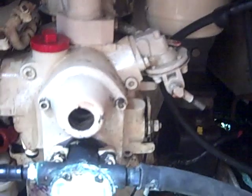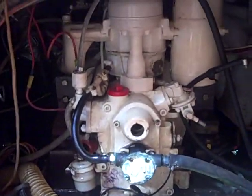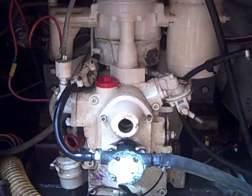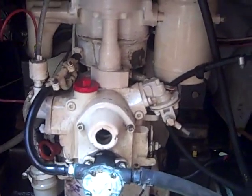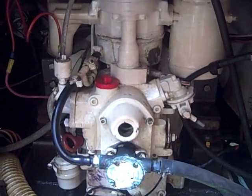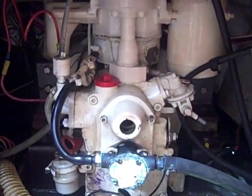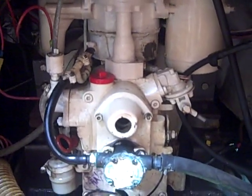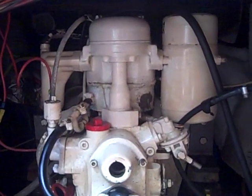Here's where you check the oil, and there's a fuel filter for that generator. It produces enough power for the boat. It makes a lot of noise, but it only eats about one quart of diesel fuel an hour — just dripping it, a quart an hour — so you don't have to worry about putting in a lot of fuel in this little generator. It's been a great, reliable unit.